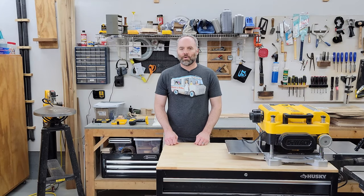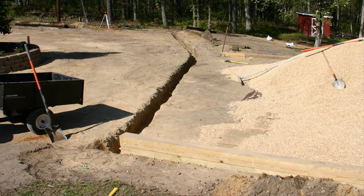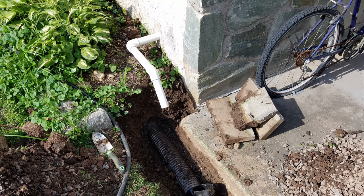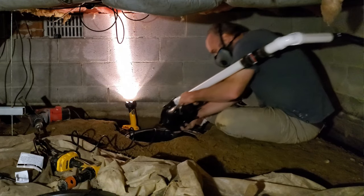While I didn't have a lot of experience with crawl spaces before I moved into this house, I did have quite a bit of experience with water management. If you're getting water inside your house, there are three general approaches you can take to fix it: one is to move the water away from your house, either by raising up the ground to slope it away from the foundation or installing some kind of drainage system; the second is to seal your foundation so the water just can't get in; and the third is to install a sump pump so that it removes the water as soon as it gets inside. In my case, I'm following all three approaches incrementally. But for a quick win, I installed a sump pump so that the water never gets up to the level it did before.